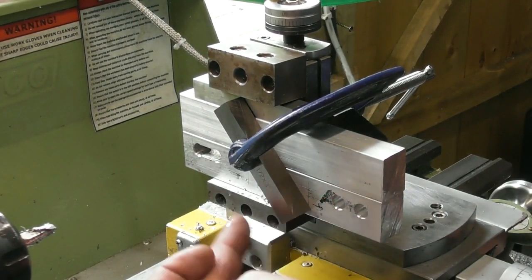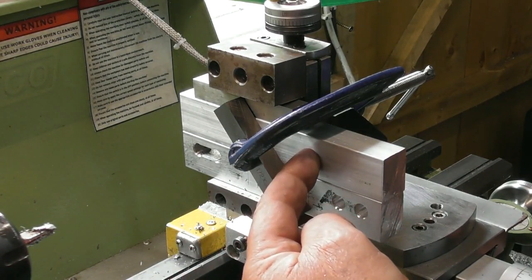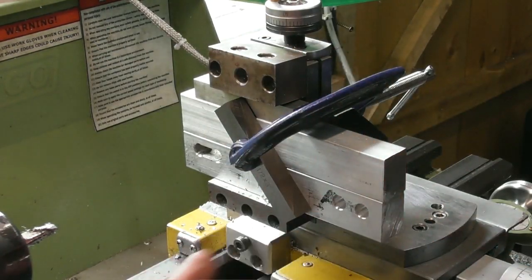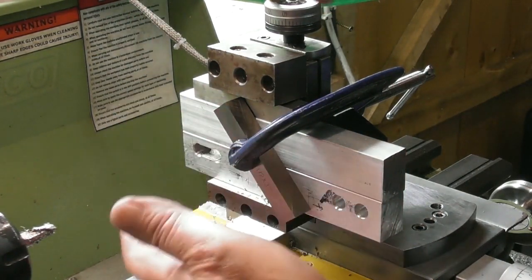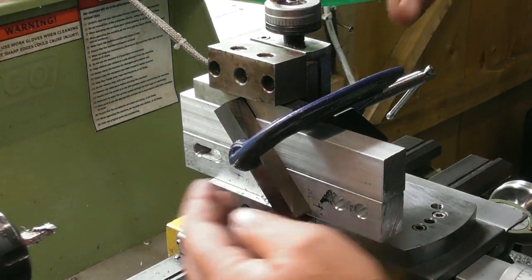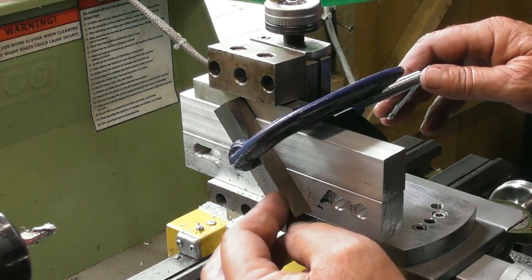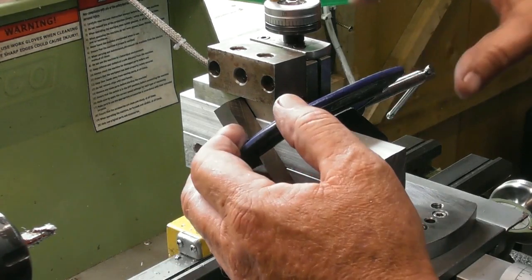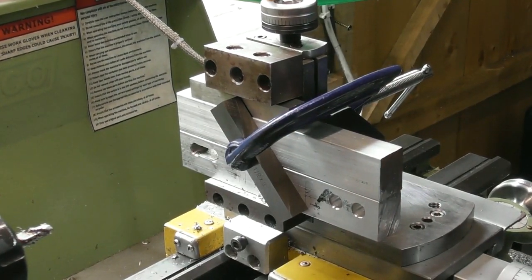I've got the part on the bottom here against the fixed jaw in my milling slide. I'm using the other part as a packer, piece of tool steel in the top, and there's 2 screws which clamp it this way, but there's nothing holding it back. So just belt and braces. I set up the height correct, or to the centre line, and I've got a piece of tool steel across the front, bridging across this part, and a G-clamp over the top, just belt and braces to hold it solid.